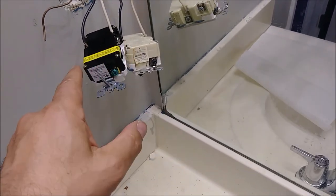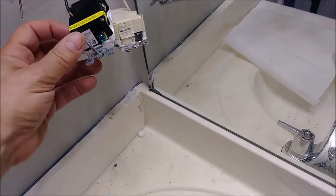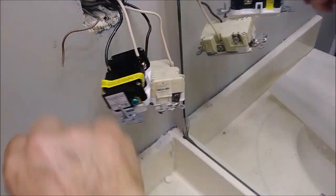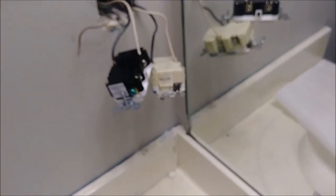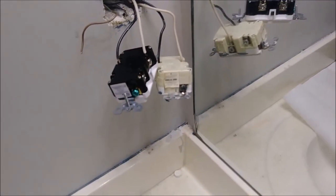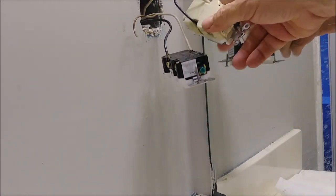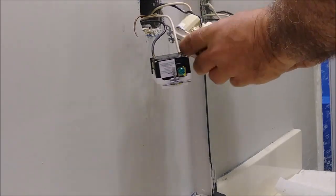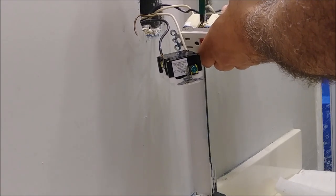Like this — I connect the source. Remember, I also have the secondary and I need to connect that too. I have to go and remove this yellow tape first. I must remove it so there's no confusion. So we know which wires are the secondary. Now it's safe to go and disconnect these two secondary wires from the old dead GFI. It's very old — this GFI is probably 10 years old. I'll show you why.